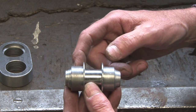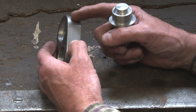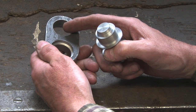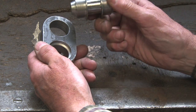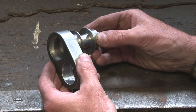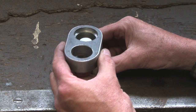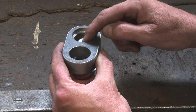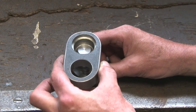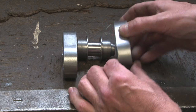This is the rough contour for a weld prep, so we're going to heat this area up, which will hopefully make this hole go bigger than five thou so that this piece will fit in there. As it all cools down it becomes exceptionally tight, rigid, and fixed — hopefully forever. Then we should end up with a good open space here where we can get a good weld.